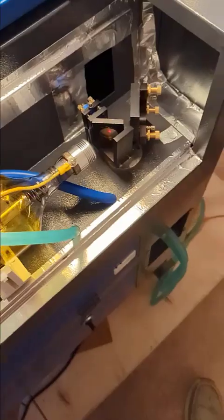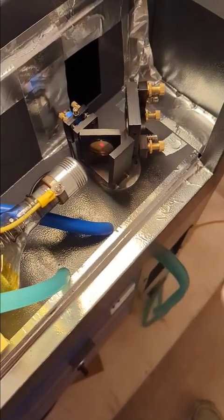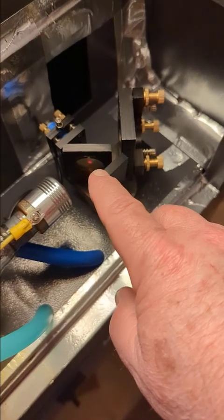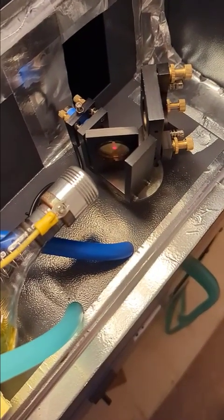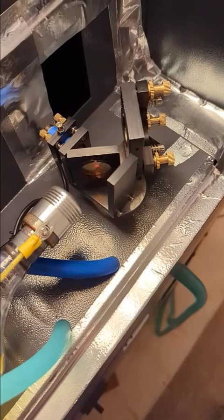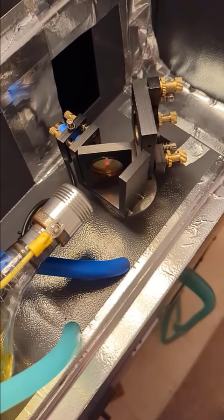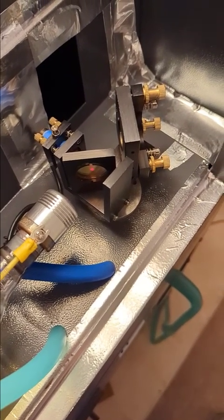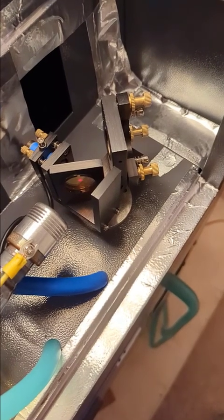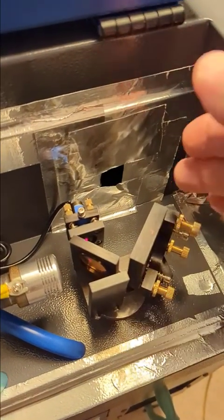The first test firing is a little bit off to the right of the circle. I spent about five minutes readjusting the height and positioning of the tube so it would coincide with the LED light, so they all travel around the machine together. If they don't hit the same spot they will diverge quite a bit. As long as the LED gets somewhere in the hole of mirror three it will shine straight down along with the laser beam.